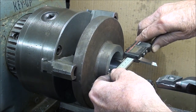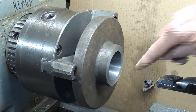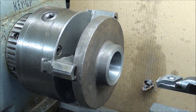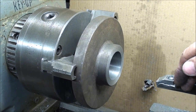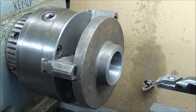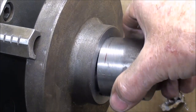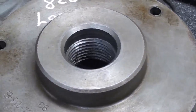I'm at my correct ID according to my little chart. Now I'm going to put a bit of a step in here - two-inch diameter, about a quarter inch deep - and that'll serve as the step where I start my thread, or finish the thread. When I'm down to that step with the threading tool, I know that I'm at the right depth of the thread. Plus, it'll help allow me to screw this onto the thread - a little bit of an alignment surface. You'll see most chucks have a step on them. The step is completed, and that's a two-inch plug I'm just using as a gauge. Can you see the step? Very much like the step on this other backing plate.